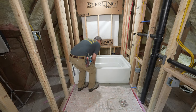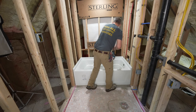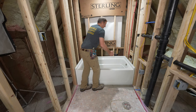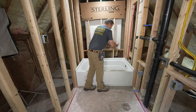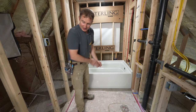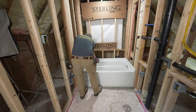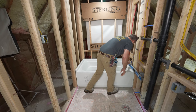The first thing I'm looking at is how much of a gap I have on either side, and how straight my back wall is. You can reference how aligned the back studs are just by looking at the flange. A lot of times these corner studs end up being out a little bit further, which could be problematic, so you want to address the framing. I've got about a quarter inch on either side. Let's put a level on it — pretty good. If you have a level subfloor, it makes all of this so much easier because now you're not fighting and having to shim things up.